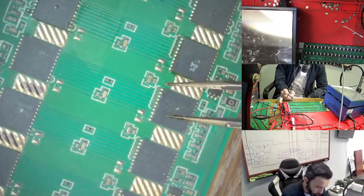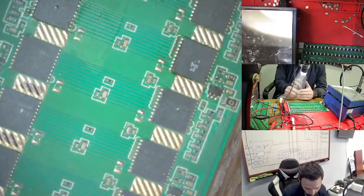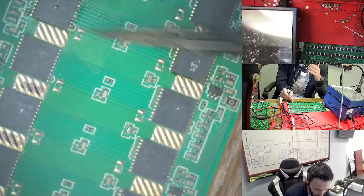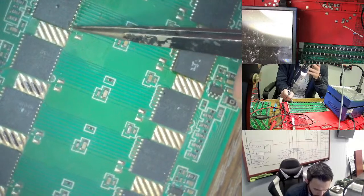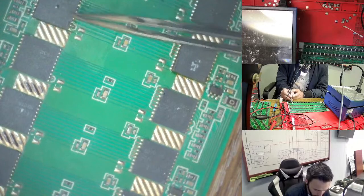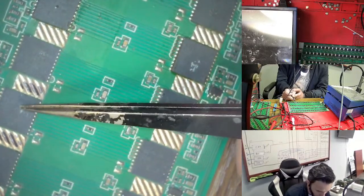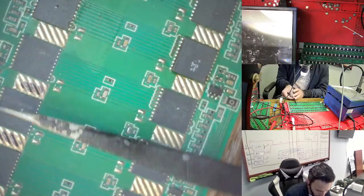I'm still trying to get one hashboard. Actually, if I get one hashboard, after that it is easy for me, but I'm still trying. Right now I understand a little bit of what is going on. If 1.5 is off, then he is not passing the signal. Here I changed this chip, and also I changed this chip, so right now it arrives here and stops again, because this domain is all green and this side is red.